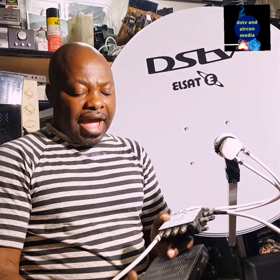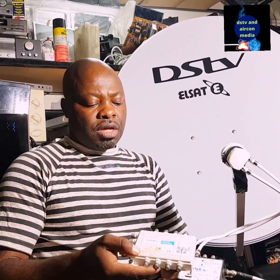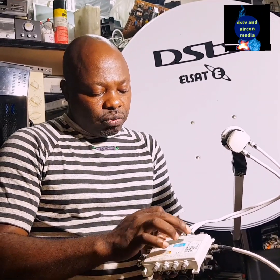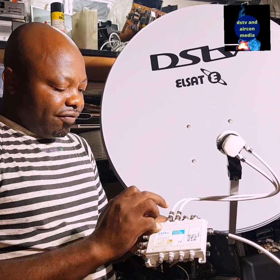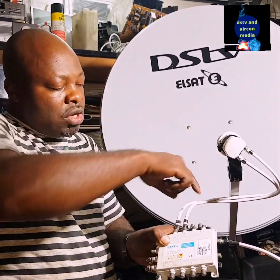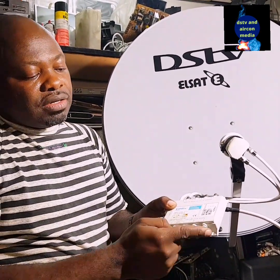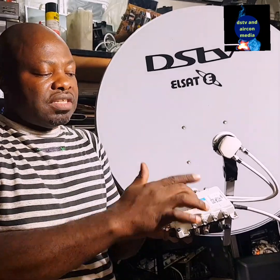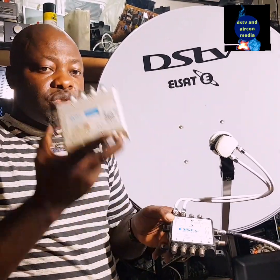There is also a different type of box you can use. With this one, you connect VL and HL — VL is this input and HL is this input. The two cables go inside this box, and on the output you get four Universal outputs to supply four ordinary decoders, and you also get four Unique Cable outputs so you can connect four Explorer decoders. This makes these switches very important for sharing your dual LNB signal.